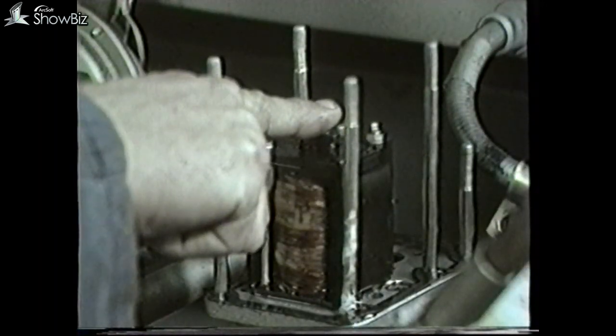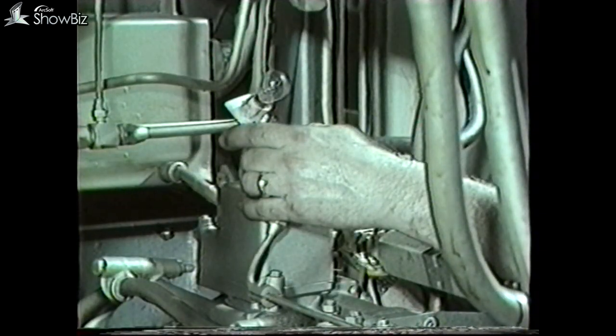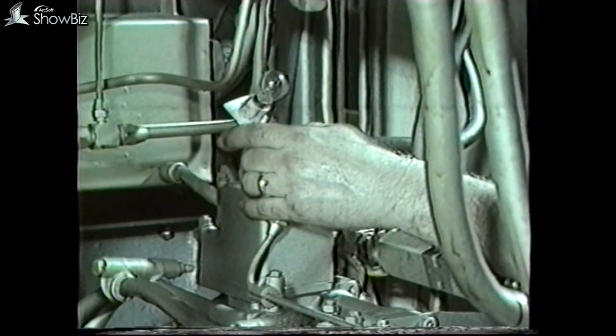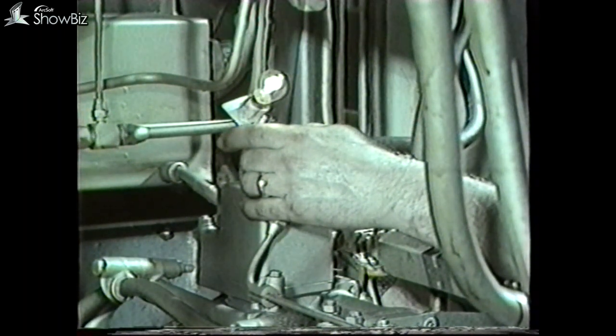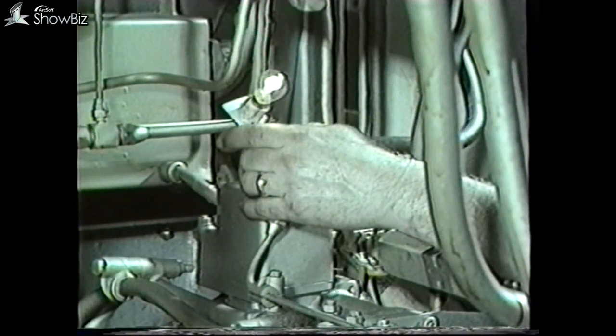If the supply is correct, you should move to the rear of the vehicle, remove the cover on the retarder solenoid and operate it and the air cylinder manually. If there is no pressure reading when this is done, it would point to a problem in the solenoid hydraulic system or the retarder direction valves. If there was a pressure reading when the retarder solenoid is operated, you should turn your attention to the electrical supply feeding the retarder solenoid.